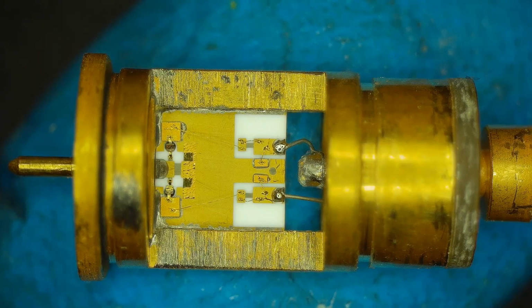So yeah, so 2 diodes, one detects positives, one detects negatives. They go onto those 2 squares there that are the capacitors. And then those capacitors then get wire bonded way back to another little just RC circuit just to smooth things out. And you can see here that they have wire bonded the resistors out of the circuit. So there used to be a little RC circuit there, but they decided for this particular sensor design, they didn't want that resistor in there. So they've wire bonded those 2 resistors out.